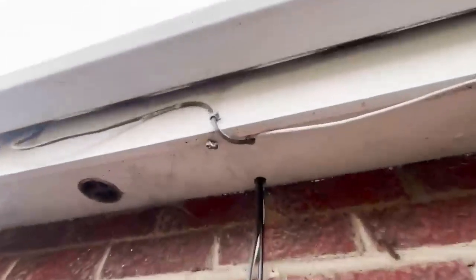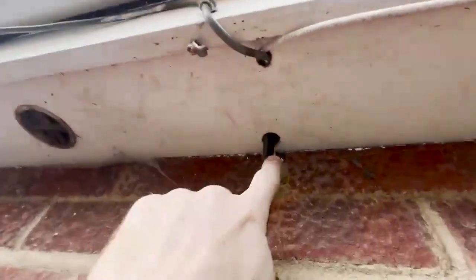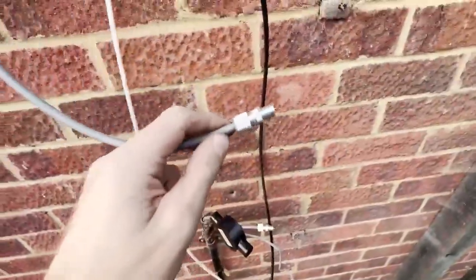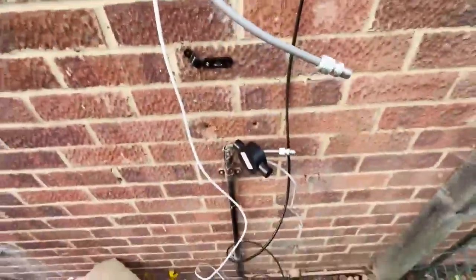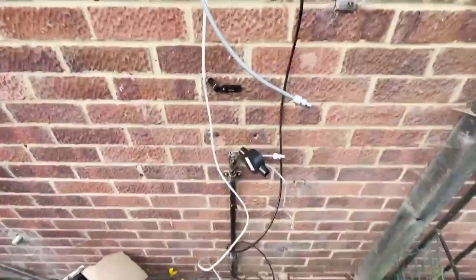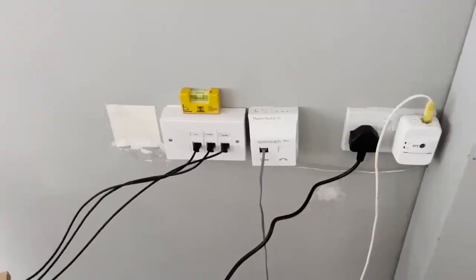The Cat6 is in. I've tidied up the coax and Cat5 — drilled a hole here and pulled it back through here ready to go into the conduit. I've put a load of conduit clips down and put heads on the aerial cable. I had to cut that to enable me to put it into the conduit. The hole needed to be a bit wider and that's where it's all going to go into.